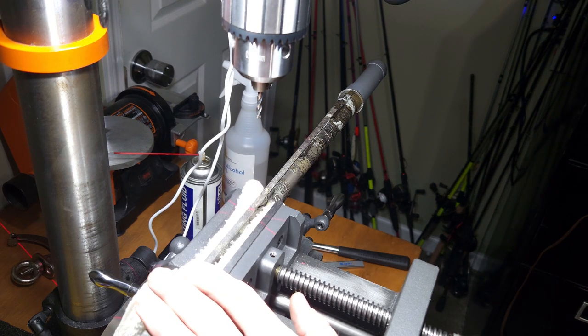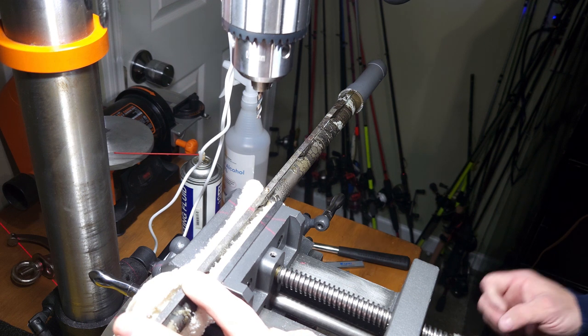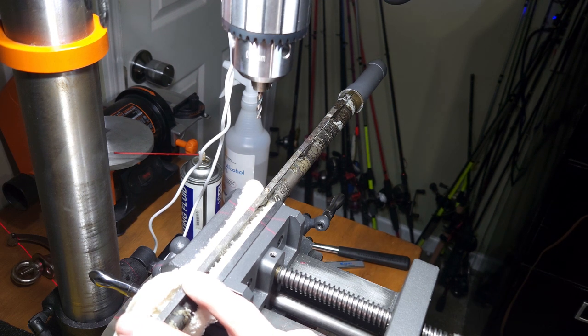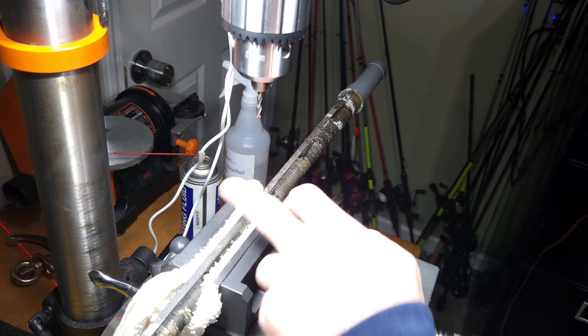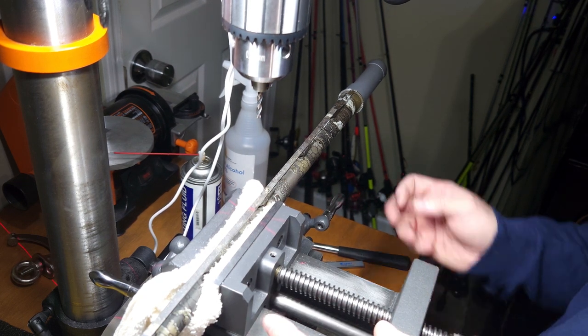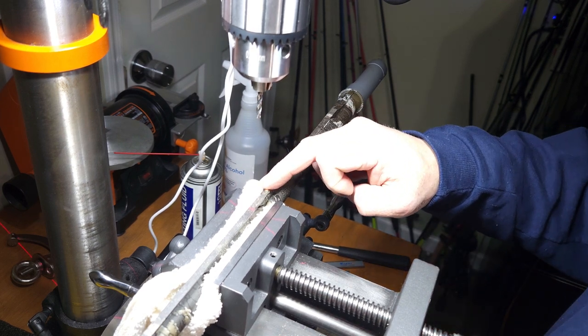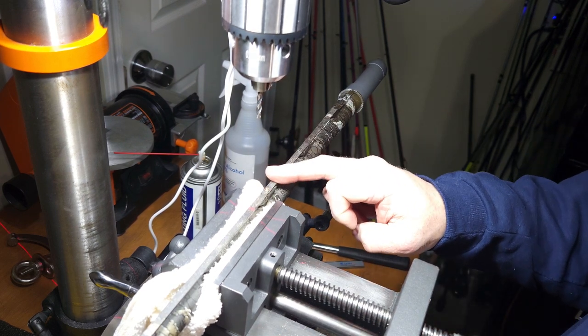However, you've got to be careful. Some shotguns are going to be thick enough that you can do it without drilling through the barrel. In fact, I've done a practice one on a real thick barrel from a single shot shotgun and installed one of these without going through the barrel. But a lot of guns, the barrels are thinner, you're going to go through the barrel. So on those guns, you can't put a mid rib or mid bead on those. You can only put the bead on the end.